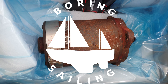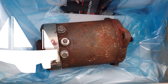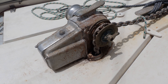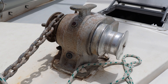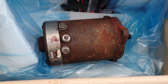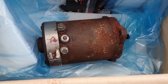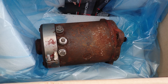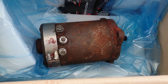Another project going on is my windlass, which is used to pull and release the anchor. It's an electric windlass and it doesn't work right now. With the help from another Amel owner — I can't say enough good things about this community — we took apart my windlass and tracked it down to the motor not working. I've got to go get this rebuilt; allegedly a car place can do it, so that is next on my list.